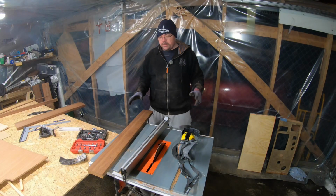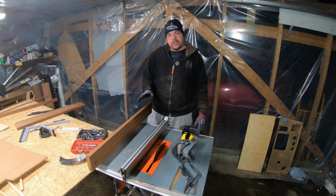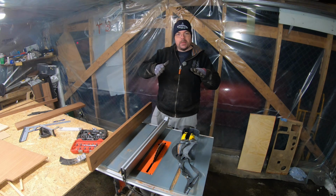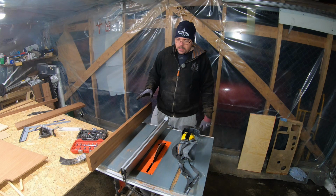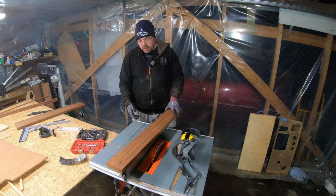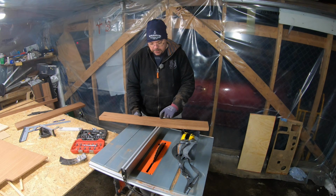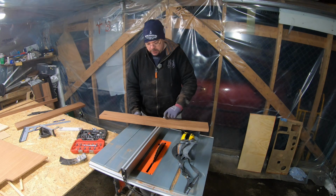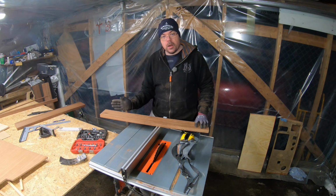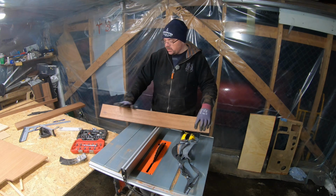Okay, so then I've been struggling back and forth with these pieces of wood because I wanted to split this in half, and for some reason my saw table isn't allowing me. It's giving me strange bevels and stuff. So what I've decided now is to go back to keeping this thickness of the wood. To make this look really nice, I'm thinking about cutting out 9mm of this edge here, so that the door is coming in on the inside here. So when it's closed, it's flush, totally flush on the outside.